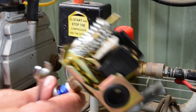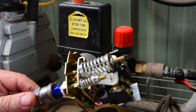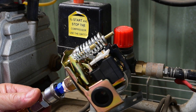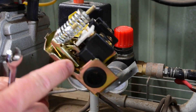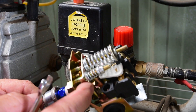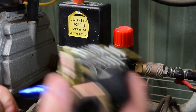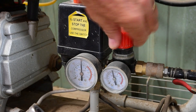So that's how I set these switches. I just find it's a bit easier here in a clean workshop than in a grubby shed full of spider webs and possibly snakes and water leaks — you know, it might be dark. It's just a pain in the neck. So that pump switch is now near as dammit set exactly right for the job I want. You just need an air fitting, a compressor, and just vary the outlet. I'll take this off first — there's my switch off. I'll wind that back up now to usable pressure.